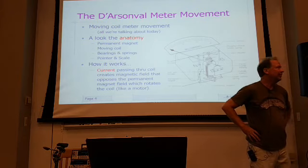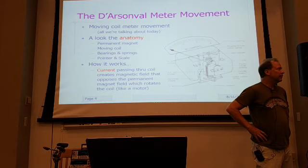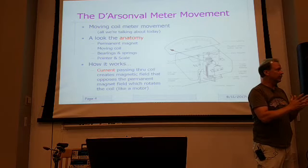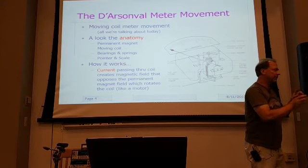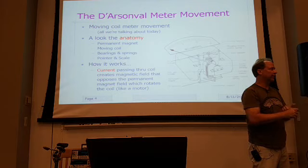Touching briefly on AC meters, some of them have linear and some have nonlinear scales. The nonlinear ones, are they like the moving vane type? They might be. I'm not really sure. I don't know enough about them. I've seen some expanded scale AC voltmeters that will read from 100 to 140 volts, so you get a nice expanded scale around 120. There's some extra electronics to do that. The other nonlinear ones might be a moving vane type meter or an electrodynamometer.